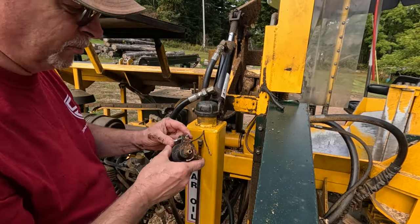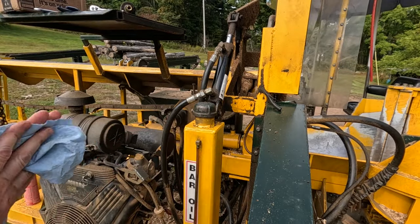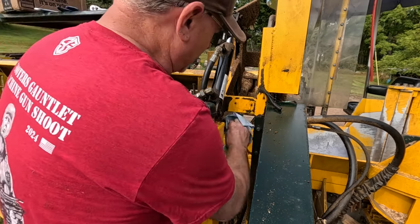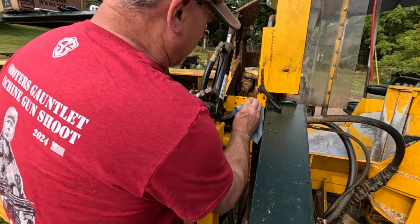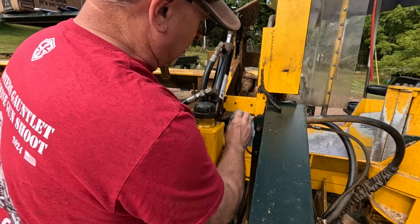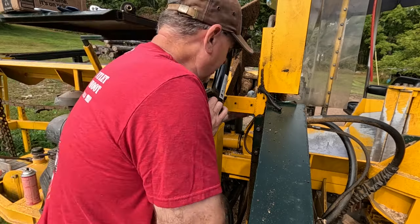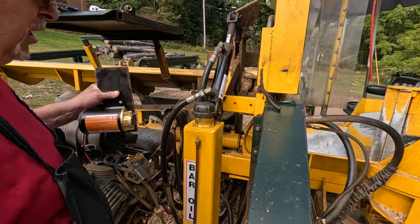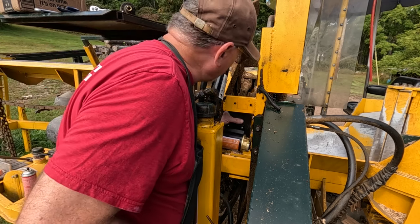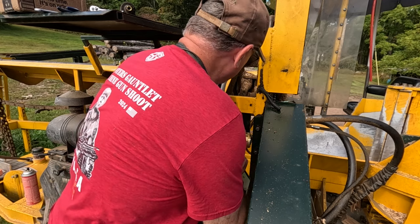Okay, here's the old pump. Okay, now what I need to do is go get the new pump and plate and get it lined up here. And I think what I'll do is clamp it in place, and then I'll use my transfer punches to mark the holes. I think that'll be the smartest thing to do, and that way they're exactly in the right spot. This pump is fairly heavy, and I kind of need to have it mounted in order to do this properly.